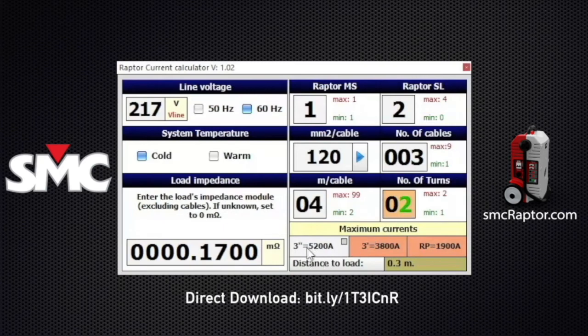What we're seeing here in three seconds, three minutes, and permanent duty cycle — when you see red for any length of time, that is going to increase the thermal or exceed the temperature on the cable itself. So this is a perfect tool to manipulate and play with, even allowing you to decide what needs to go out into the field before you load up that truck or van, telling you whether you need just the main Raptor system or whether you need to take one, two, or more 5KVA slaves along with you.